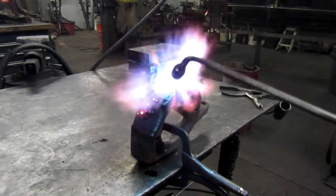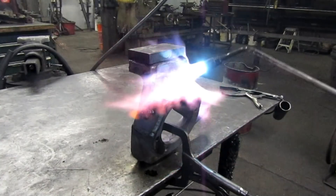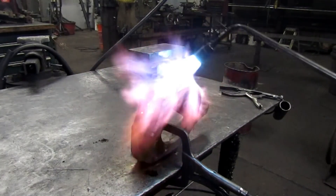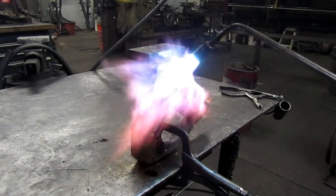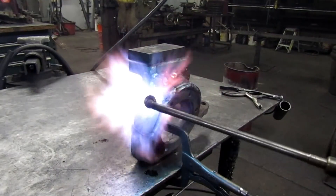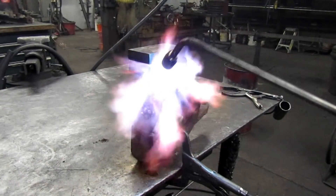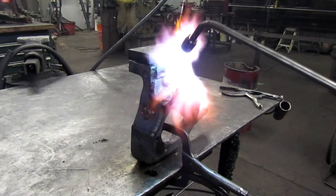One thing to keep in mind — you should dry assemble this before you go to do any painting or finishing. Make sure your brake bracket has enough clearance to go over these plates that you've added. You've added thickness into this thing, so you want to check that out. Finishing it up and then we'll get her buried.